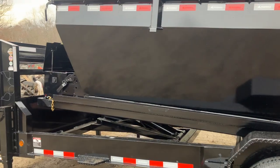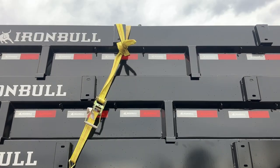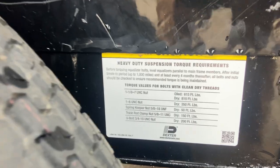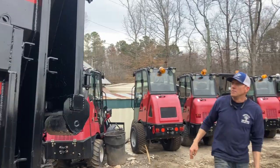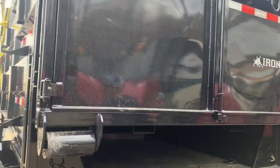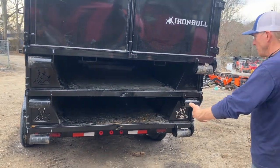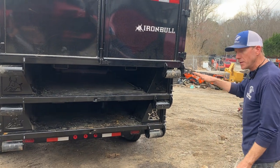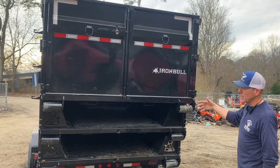It's kind of neat that they add a step here. We've got it tilted up just enough so you can see that hoist. As you can see, we've got three cans stacked — I don't want to tilt it up too much and have my stack slide. That's a Dexter axle with heavy-duty slipper suspension. Coming back here at the back, they're tub-bottom cans, which is pretty much the same on all trailer systems. They build them tub-bottom so the deck can sit lower, allowing the tub to sit between the fenders and keeping the canister lower and more stable than a deck-over system.